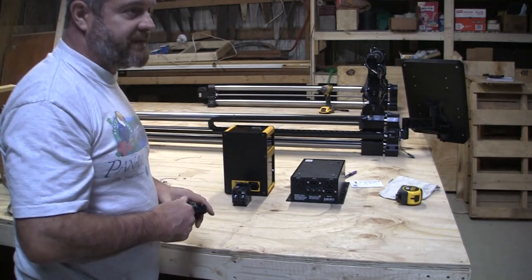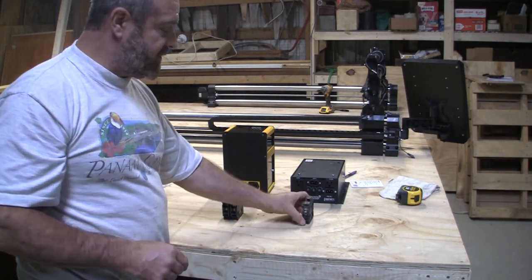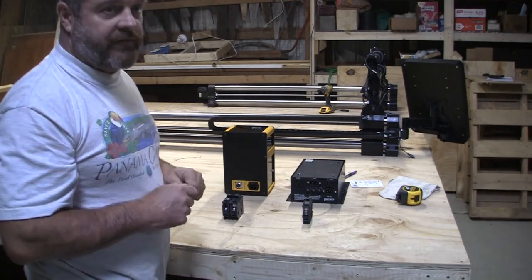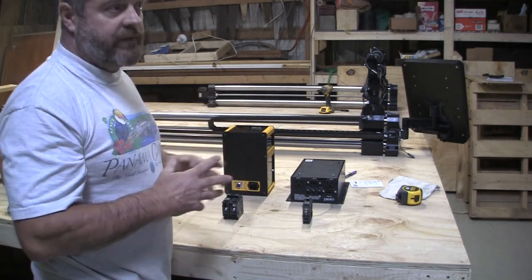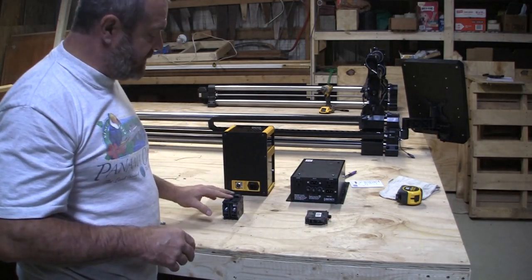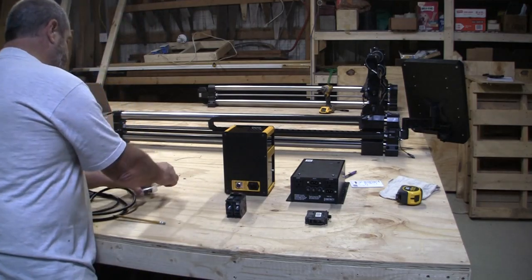Let's get these guys plugged in. So, I'm going to hook up my 220, and I'm going to hook up my 15. I'll test them out. Hopefully everything will work, and we'll be good to go. This is going to be run on 14.2 cable. This is going to be run on 12.2.